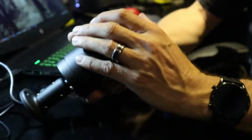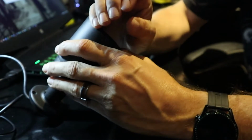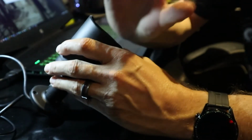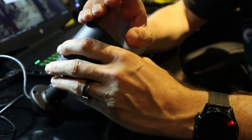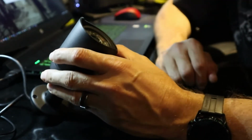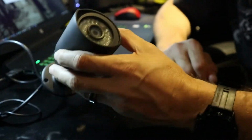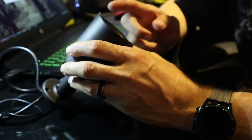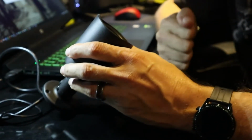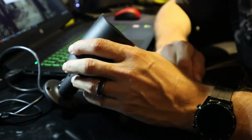And what I'm expecting, now normally with these Oaks, remember they're infrared, so if you cover them you should see some red lights coming on. Okay, this is as I suspected. We're not getting red lights, and I think you might even be able to see that on the camera itself. I suspect it's because my PoE from my switch is not the correct kind of PoE that this Oak is actually expecting.